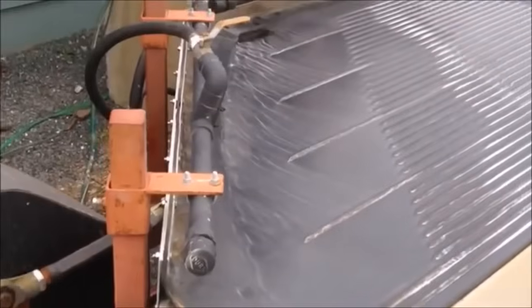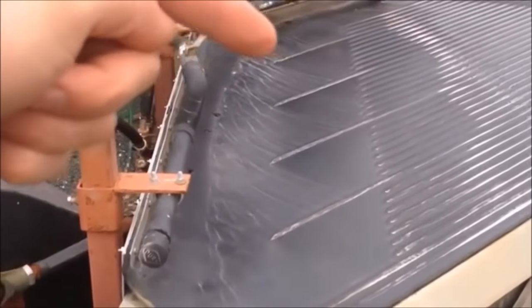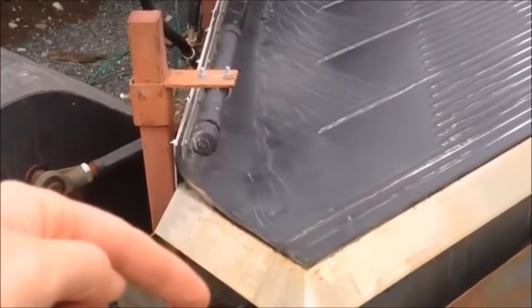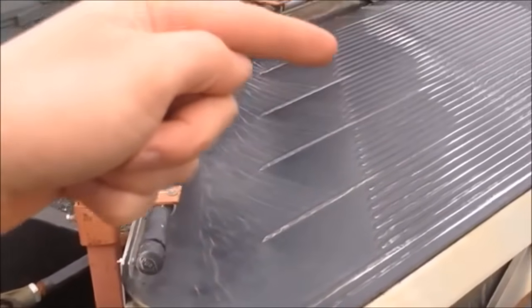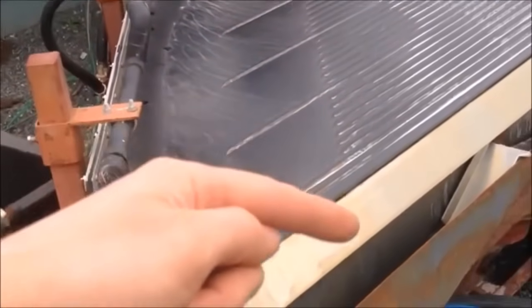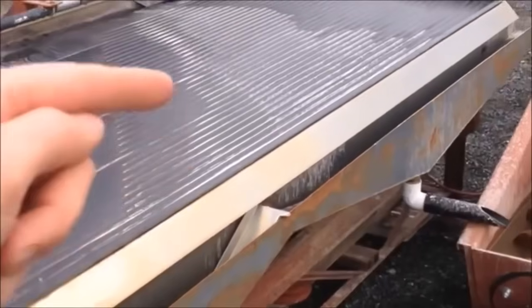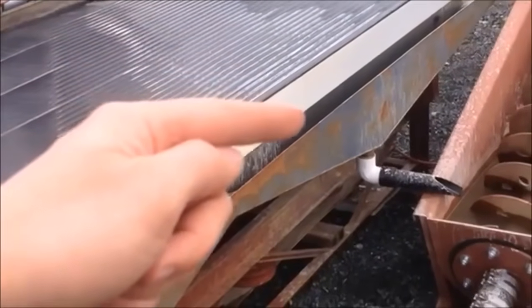The high-grade material and the gold is going to come across these grooves and make a line down under the water bar here into the number one high-grade and number two high-grade. Your sulfides and concentrates are going to come down, form a band at the tips of these grooves, and come down into the number three port or the middlings. The quartz and waste material are going to come down into the tailing port.